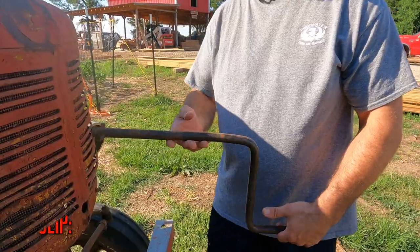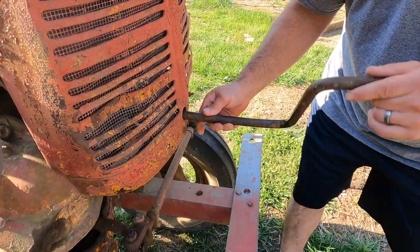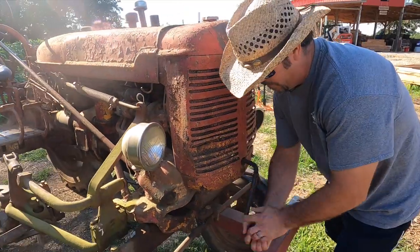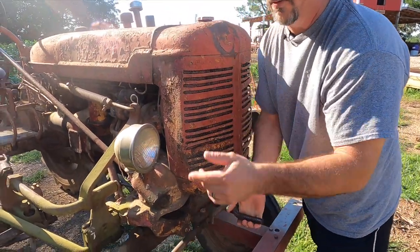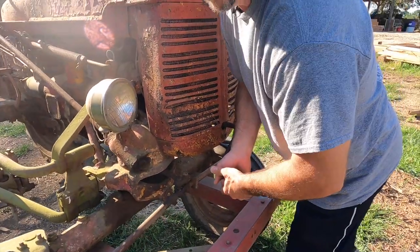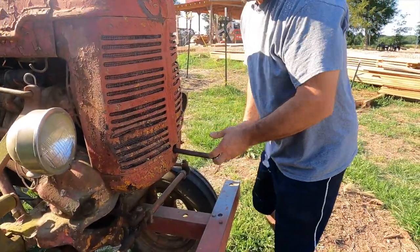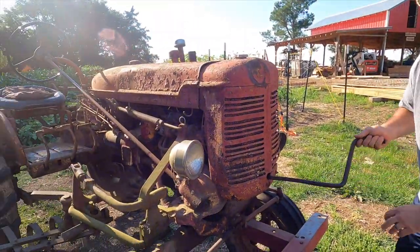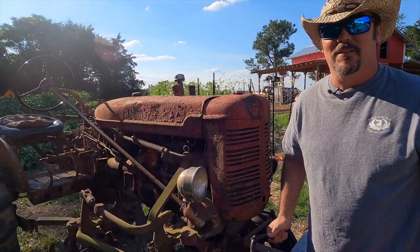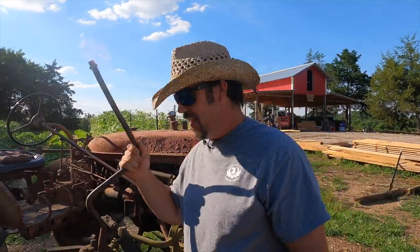This hand crank's got a key way in it — you just kind of funnel it around in there and find a slot. You want to get it right here where you engage the motor. I always like to do it like this because you'll have a kickback sometimes, and you can let go of it — a kickback can sometimes break your arm. The only thing you do is pull on it. Takes a couple of runs, but that's hand-cranking a Super A tractor right there. Most of the time we use a starter, but wanted to show you how to hand crank one. Hope y'all enjoyed it — have a good one.